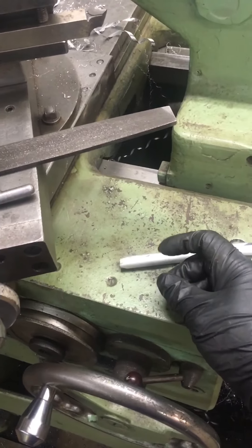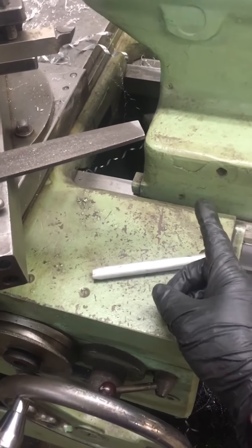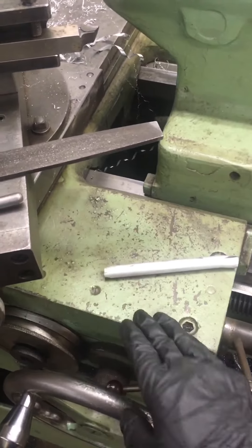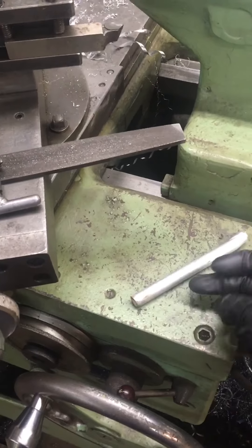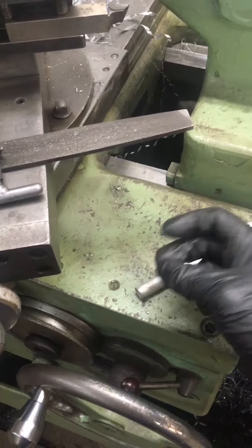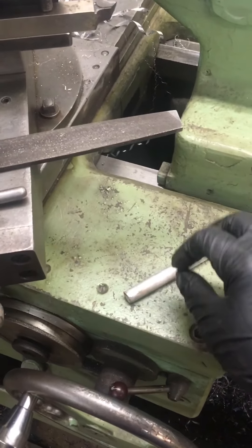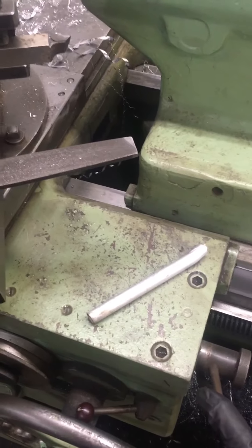What I'm going to do is center punch and drill a quarter inch hole basically where all my holes need to be on the frame. I'm going to thread this piece so it'll be hollow, so a bolt can come in from the back side. Then this will fit inside the annular cutter to center it exactly on the hole. That's my plan — let's see if we can make it work.